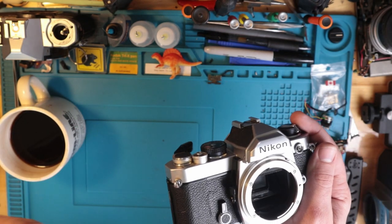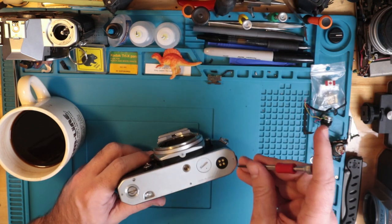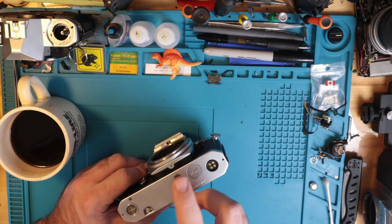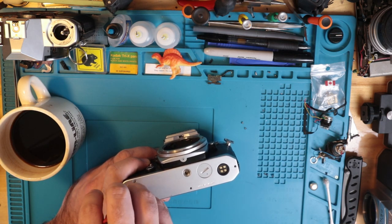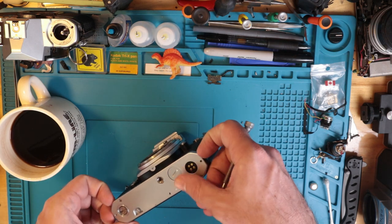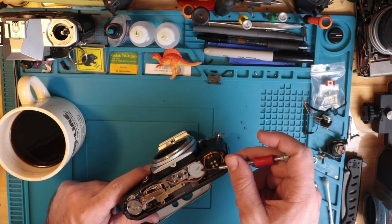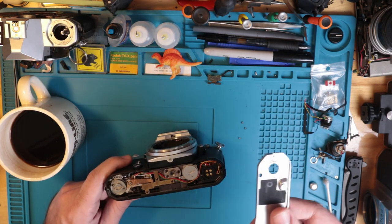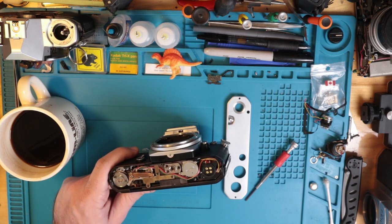With Nikons there's a very terrible system that they use — I personally hate it more than anything. It's kind of the root cause of a lot of the issues with them mechanically speaking, and that would be their advance mechanism here in the bottom. They use pretty much an identical shutter to the EM/Super, like a Copal shutter, vertical traveling, horizontal traveling. One thing I do like is that the battery compartment lid is separate from the bottom, so you can pull the bottom off and not have to worry about batteries flying everywhere.